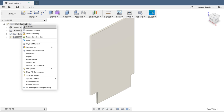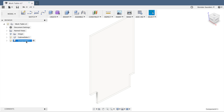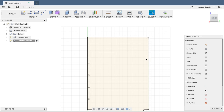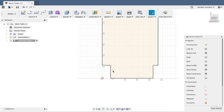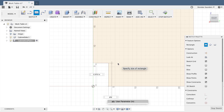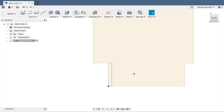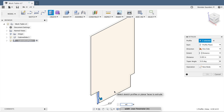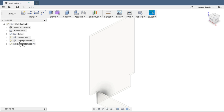Next I'm going to create another component for my kick plate — I'll call this cabinet kick plate. I'll create another sketch right off the side of the previously drawn cabinet side. Down in the front area, I'll grab my rectangle tool with R, and this is going to be a plywood thickness by kick height. I'll stop the sketch, select that profile, swing to 3D view, hit E for extrude, and bring that out by my width.